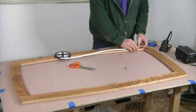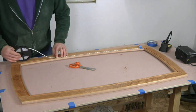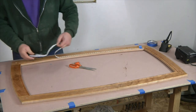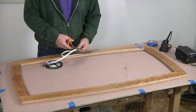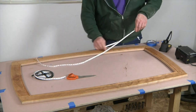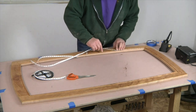Next, it's time to fit the LED light strip into the channel around the bottom of the top. The strip must be cut into four segments, which are then wired together at the corners where they meet. Once a segment's length is determined, it must be cut only where the four copper solder pads are in a row, which occurs every few inches along the strip. When you're ready to attach an LED strip, first peel away the backing paper that covers the pressure-sensitive adhesive on the underside of the strip, and carefully press the strip into the channel.